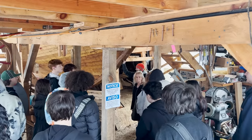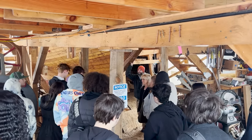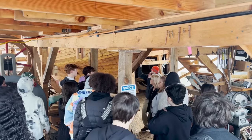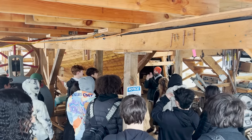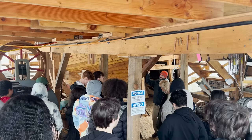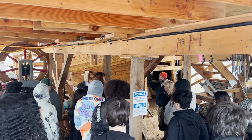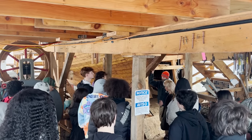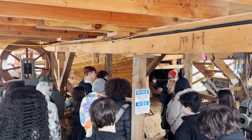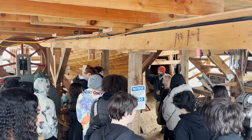Does anyone know how modern bearings work? So ball bearings, are you familiar with those? If you got a shaft, normally you have a whole bunch of little bearings, little balls around it that are lubricated, and that lets that shaft spin. Before we figured out that kind of machining and tolerance, they used Babbitt bearings, and it's basically a lead alloy, and you put the shaft in a casing, and you pour molten metal into it, and you create a casting around it. You open that up, smooth it out, and it runs in an oil bath.